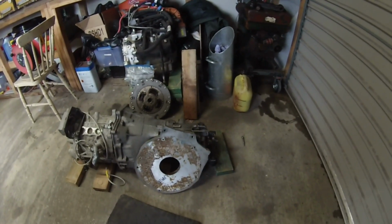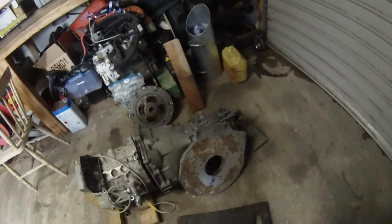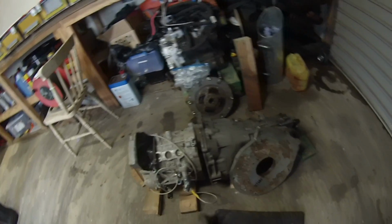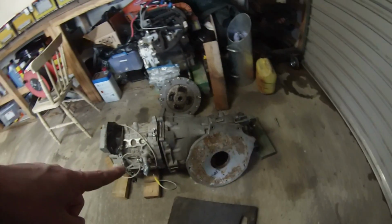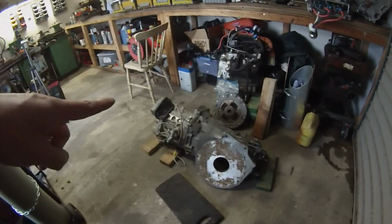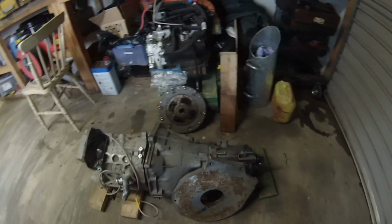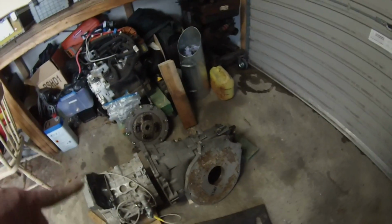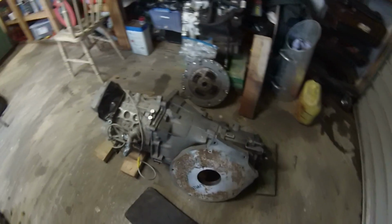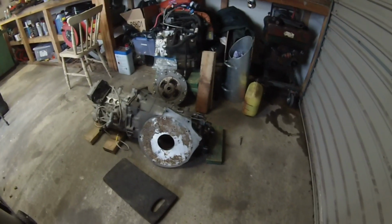Now, this is a piece of 25mm thick aluminium that we basically cut out to the same shape as the gearbox bell housing. This is a plate that I used in my E39 with a DC motor, a very same type of gearbox as this, so we can reuse this adapter plate. It was basically just drawn around with a permanent marker and cut out with a jigsaw. And yes, that was a pain in the neck for sure. But it still got done and worked fine for the last 5+ years.